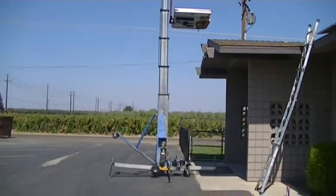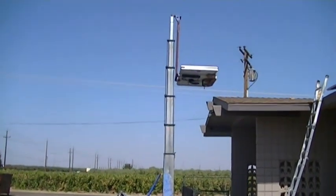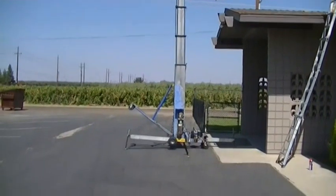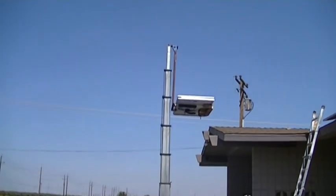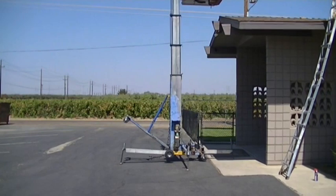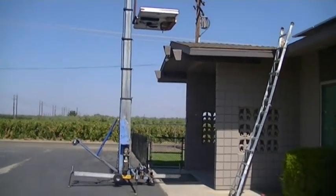One piece of equipment you might want to get: I got a single-man lift — an Upright brand — bought it used. I took the man basket off and welded on some forks. We can lift anywhere from up to six panels at a time depending on size. This goes up to 32 feet high. I paid about 900 bucks for it used and it's been working great for years and years. It saves a lot of trouble especially on two-story buildings getting the panels up.